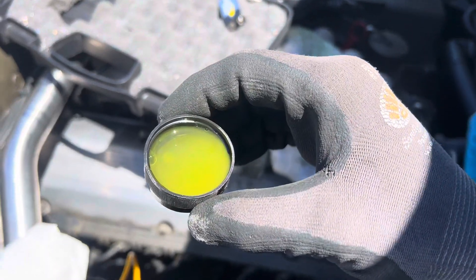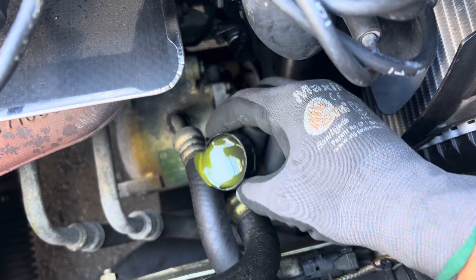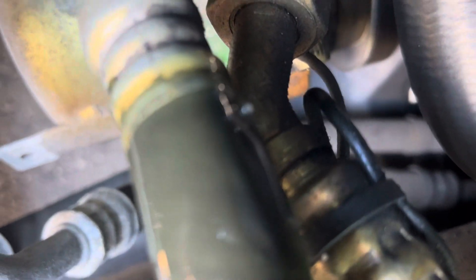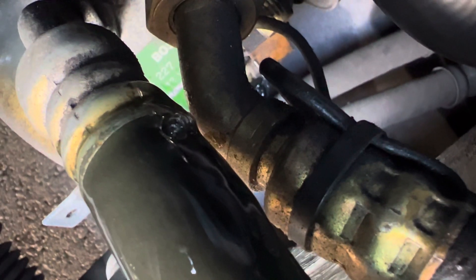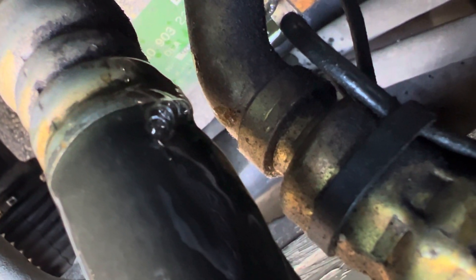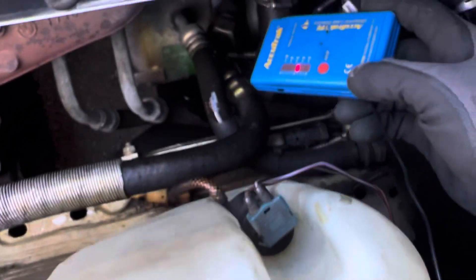Let's do one other thing. Here's some concentrated bubble soap — let's pour it over that area and just douse that whole area. There's a little bubble right there in the rubber hose. It's not coming in from the fitting — it's coming right there. The way I found that was just by not using any refrigerant, just using pressure to pick that up.